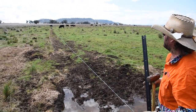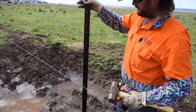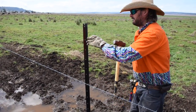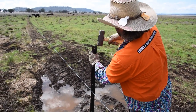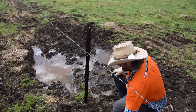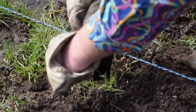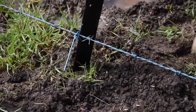This line is hanging nice and level apart from the cow that's walking over it. To make sure our post is level we'll just dangle it right next to the wire there. We'll drive it in on a little bit of an angle to help it hold into the ground. That looks nice and neat. We'll just take some tie wire and pin it down to the ground level here. And that line is set, ready to go.